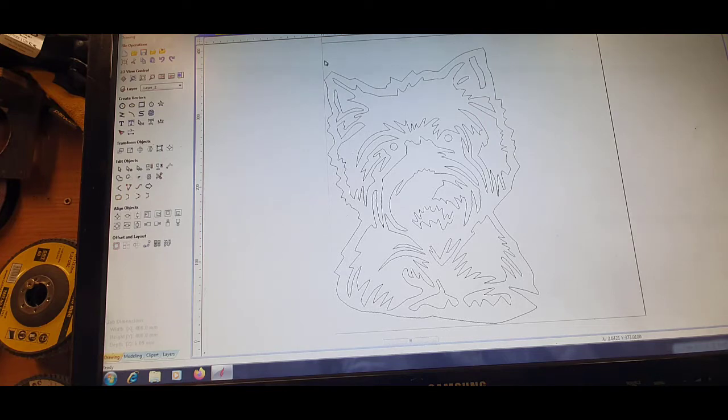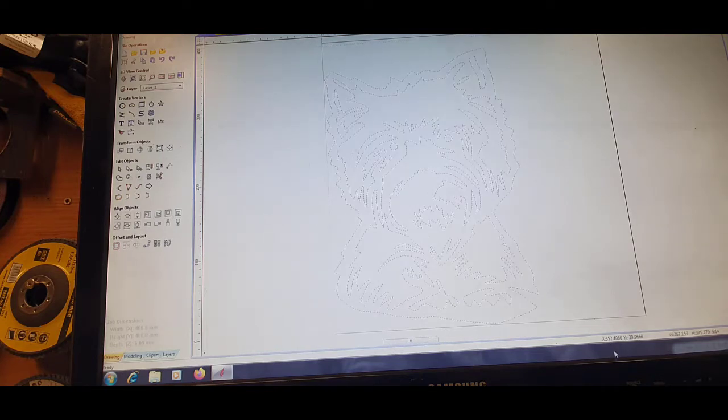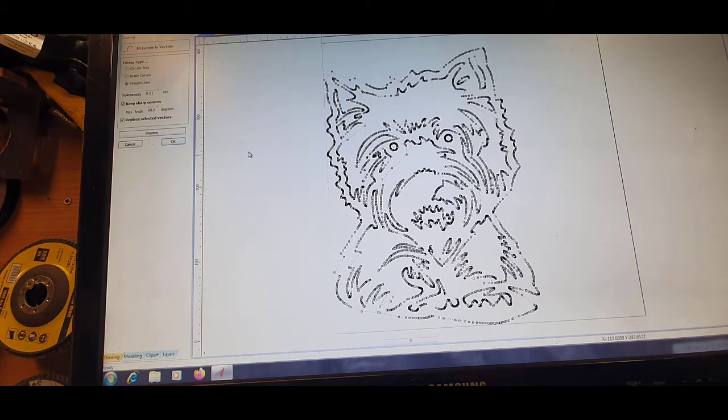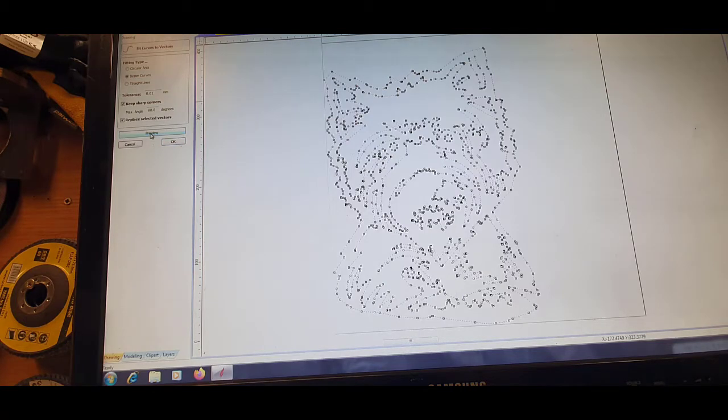should look good. Once it's exported to a DXF, what I have noticed is if you click this fit curves to selected vectors, you can get an option. Generally speaking, a DXF will transfer it to these straight lines here. Tons of nodes. Sometimes it makes for a not so good cut. It just depends. But I generally convert it to Bezier curves, which obviously is a lot smoother. If I just export that to a DXF, it'll obviously go back to all straight lines.